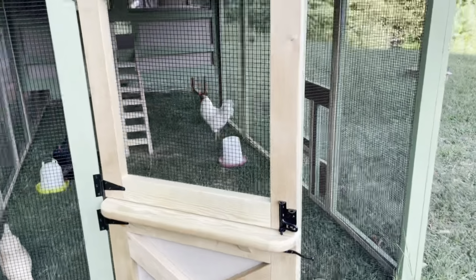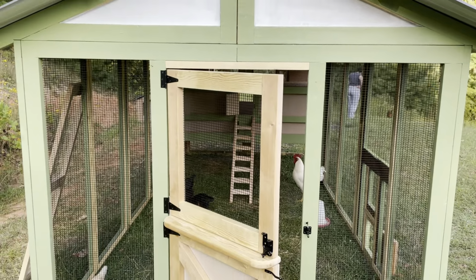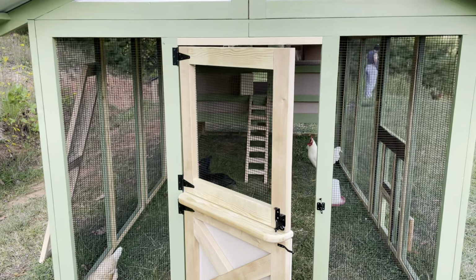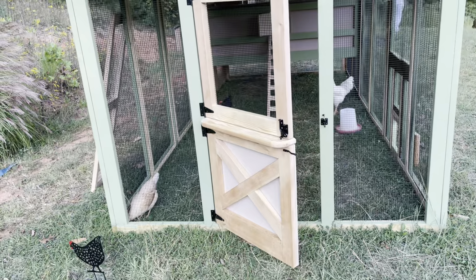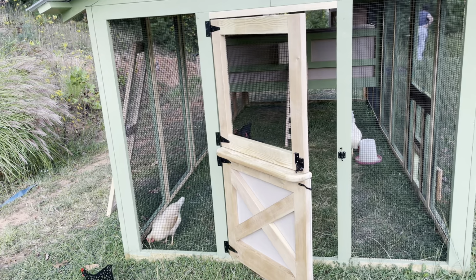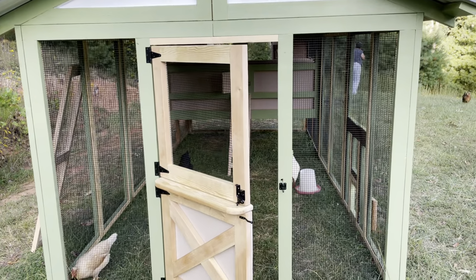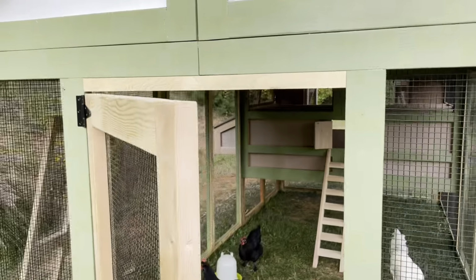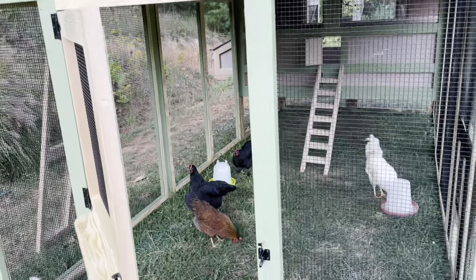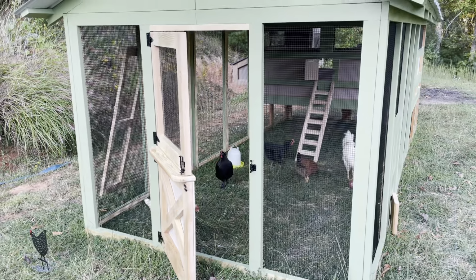So this is another thing that I know I told Evan about, but this spacer, if I can get my hand right, in the regular directions for the regular door, it shows it putting it down here at the bottom, just as a step. The double Dutch instructions don't mention it at all. So we actually hung it and realized we had a 2-inch space. And I asked about it, and I think this is part 83, if I remember correctly. And sure enough, this is in the regular, but I was like, oh, we're doing a Dutch door, I don't need to pay attention to that, but you do. So that's something, and there's the double Dutch door instructions.